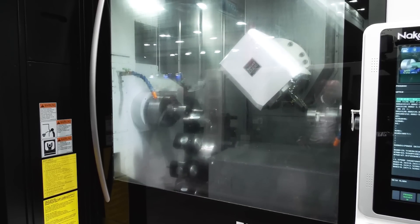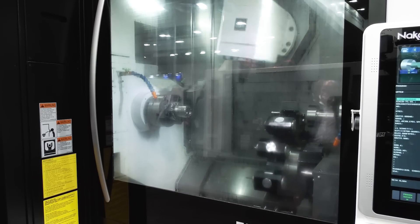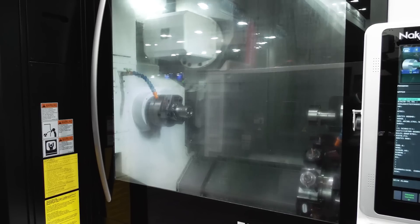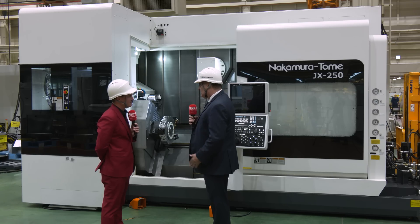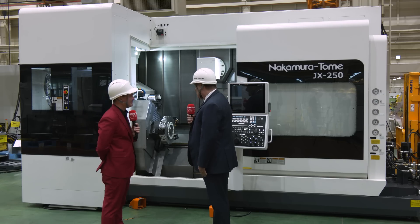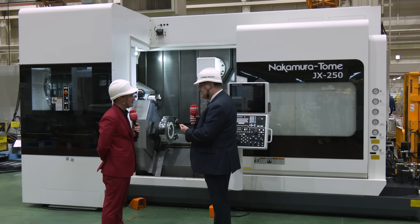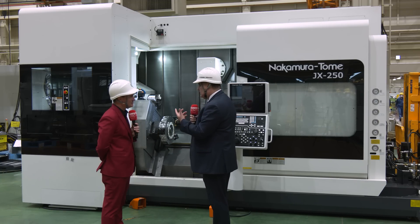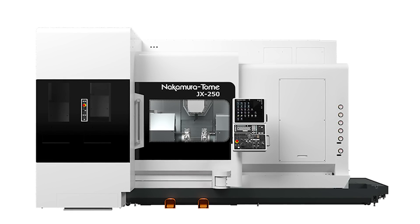They call these spindles the 'smart cube' — a new unique design by Nakamura. It's a shorter spindle in this class, and the idea is to be able to put three tools in a cut on a machine like this. If you have too large an upper spindle, you run out of real estate. By the time you get the spindle horizontal at the centerline doing ID work, you might not have room to do other work with the lower turrets — so the lower turret becomes just a support unit. But with the smaller spindle, you can put three tools in a cut: support the part with a steady rest, support with the center, use one turret, and cut with two turrets. Landing gears, yokes for aircraft — there's been a lot of different aerospace components made on this machine.